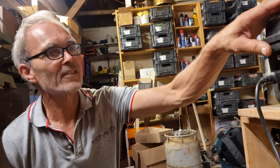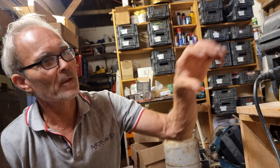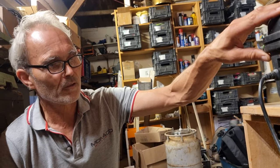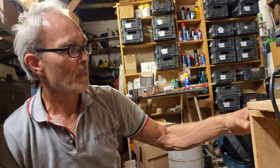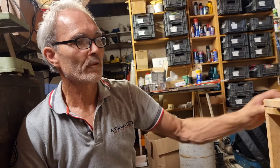source some materials like this AC power meter. The power factor of this installation is so bad that measuring the AC power input is not very accurate. So I went to the DC power measurement here in front of the system.